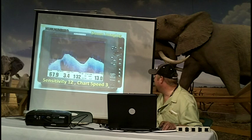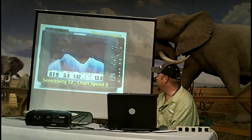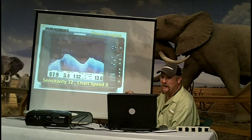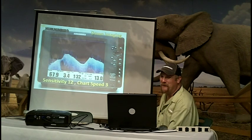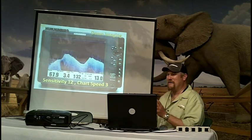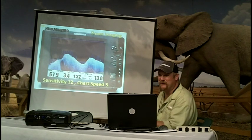Here is actually my recommendation — setting chart speed to match the boat speed. There is that tree we've been looking at; that's the way it naturally looks underwater. Our bait ball is more condensed, not stretched out. Our detail is a lot higher. We can start seeing rock ledges and softer returns. If you're getting the maximum amount of detail, that front-cover picture image is exactly the way it's represented here. Your fish will be a little harder to see because it's condensed, but you can use the advanced feature to stretch that image to make those fish pop.